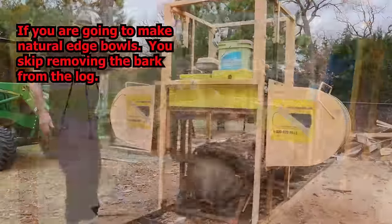All right, first bowl. The end grain is running this way. I do not wanna coat the whole thing. Now the end grain's running up and down, and all I wanna coat is this end, the end grain piece of it. Then I want to coat just a little bit over the edge on the end grain end of it. Notice I'm leaving this side and this side open. I'm not putting anything inside. All right, one down.